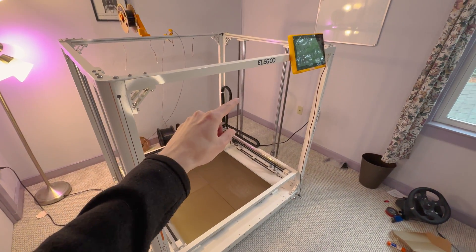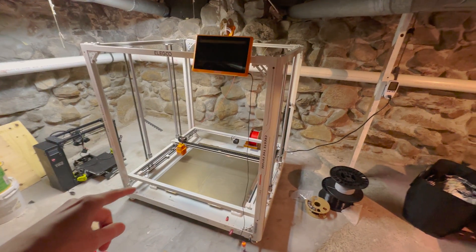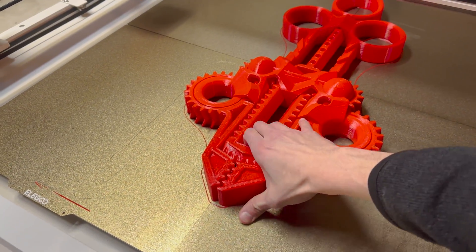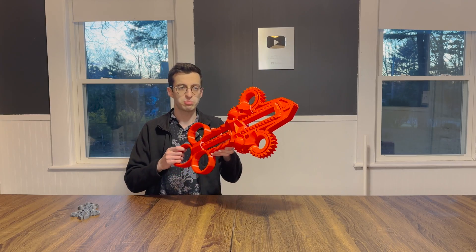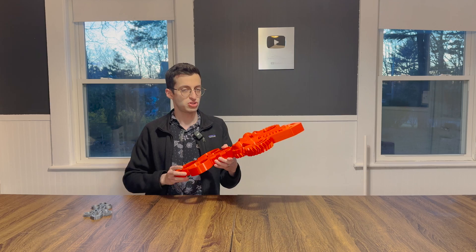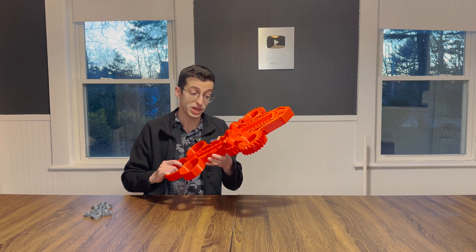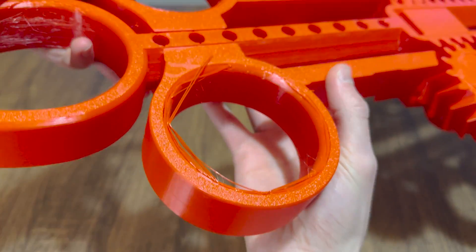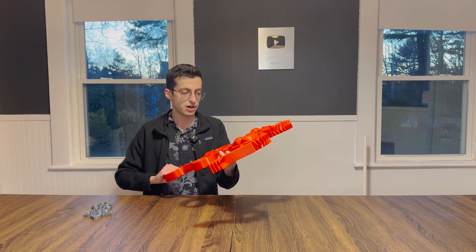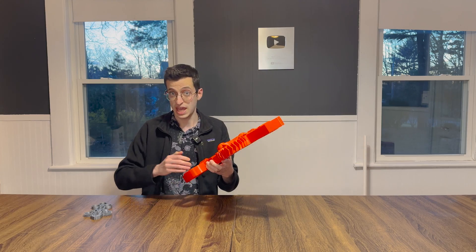I want to move this printer into the basement because it's really loud. The printer is now in my basement — it only took one weekend to take it apart, move it downstairs, and put it back together. The first big print I made after moving it was this enormous plunger gripper at 300% scale — this is what a normal one looks like. This huge version took 15 hours to print with a 0.8mm nozzle at a 0.4mm layer height. The first layer was a little sketchy, but the rest looks good. It functions well as a print-in-place model, no issues with the gears, and it only failed once.